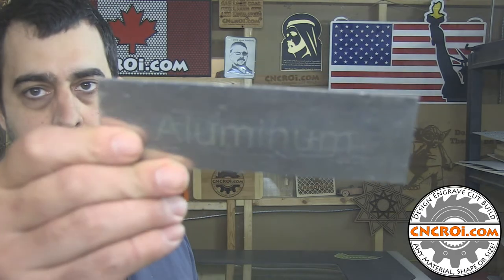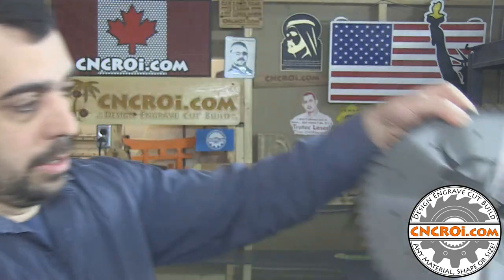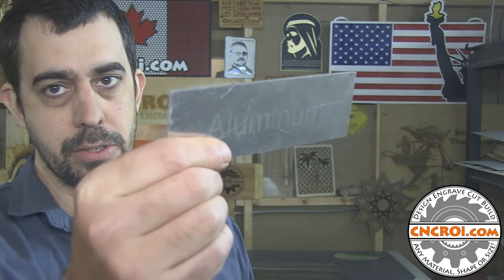Here's something I did about 2 years ago in my shop, just to give you an example. And this here was actually jet black, like this here. The difference is what I did with the fiber laser will stay that color. You got to use basically an angle grinder to remove it, and at the same time you're removing the whole surface of the metal to remove the fiber etching. Well, this stuff here, after a couple of months, I was able to peel with my fingers.